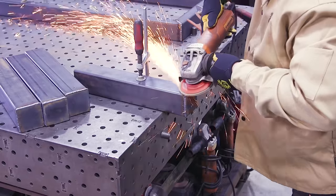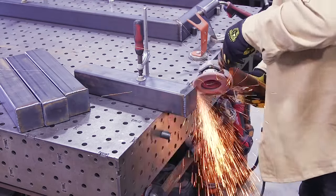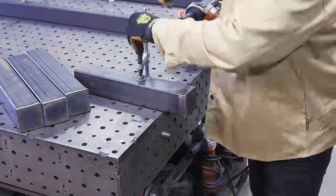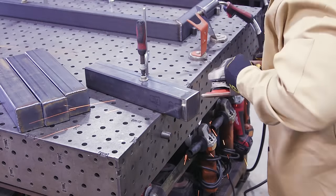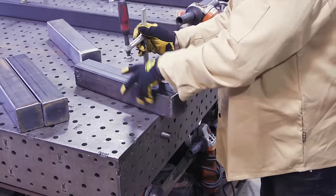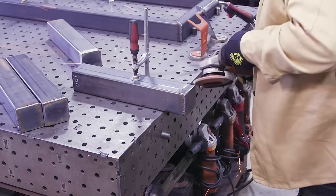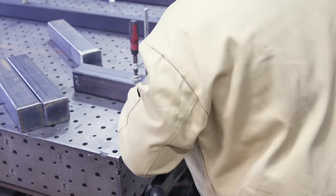There are the four legs welded on — and that's what I mean about not paying attention. This is what I normally do to everything I build: weld and then grind down. I wasn't even thinking it needed to be any different. It looks nice and clean, but that's not the look I was going for — I wanted it a little rustic. It's too late now. You can see the shiny metal where I took the mill scale off on all four legs. It was a challenge to hide, but I was able to conceal it later with some metal blackening and a paint mixture.